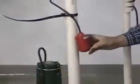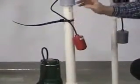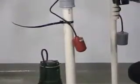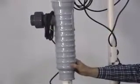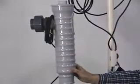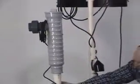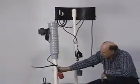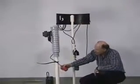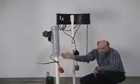Right next to me here, I have a pump, which you would see in a lot of systems, with a standard discharge pipe. This happens to have a pressure filter on top of this discharge pipe, as it would be going to a mound system or sand filter system. This is not nearly as convenient to service. This float is attached to this discharge pipe. Now, to service this, you're going to have to pull your entire pump from the tank.